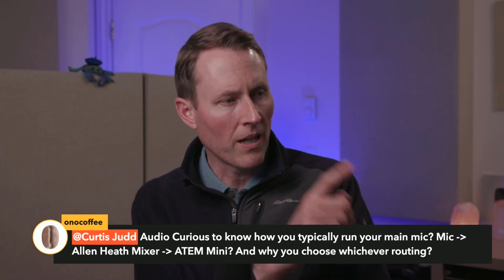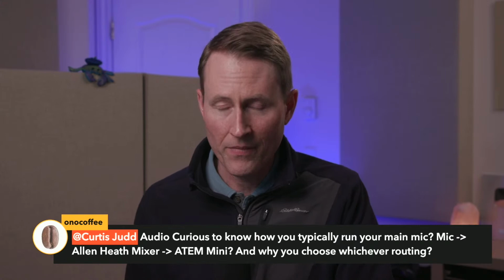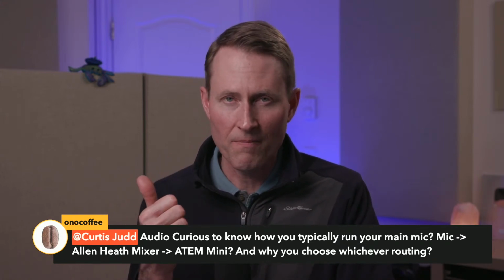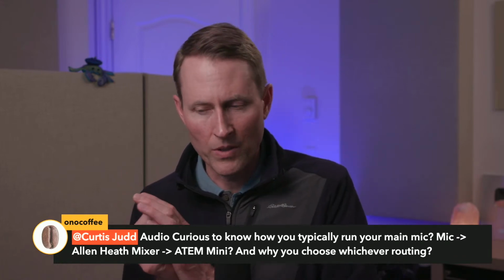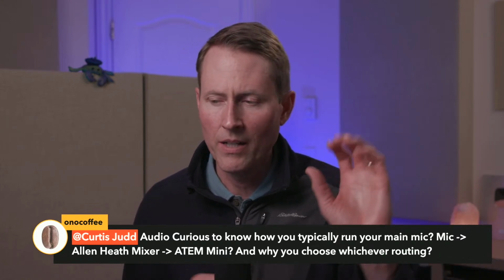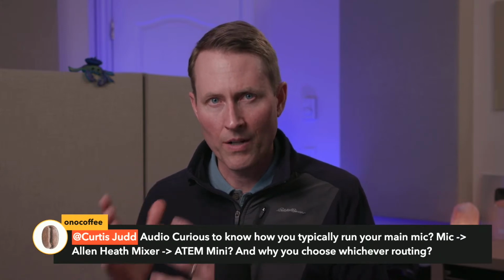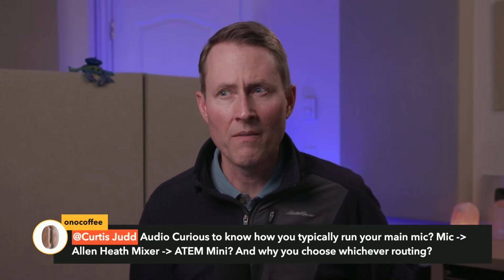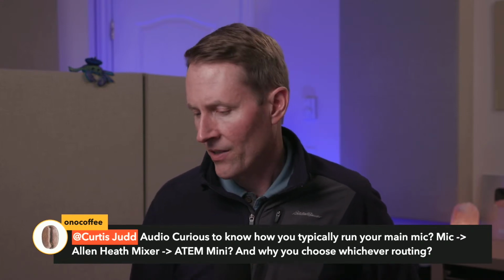Now, if I were to run the audio from the Rupert Neve Designs Shelford channel into the ATEM, I'd have a couple of problems to solve. The biggest one is probably the latency of the video. The video would come in much later than the audio would. Also, the Shelford channel has a balanced output and the ATEM Mini has an unbalanced input, so I'd have to overcome that too. Both are surmountable problems, but for me, it just makes more sense to go into the camera in this case. So that is typically why I do it.